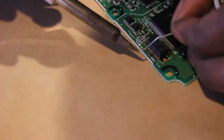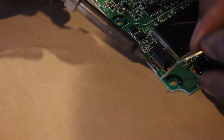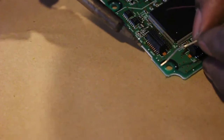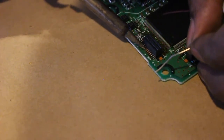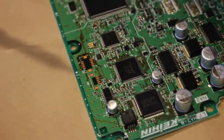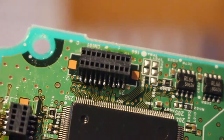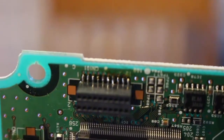I did have two of them jump. The best way to go about that is to leave them alone, let it fully cool, and then go back over one of them with the solder and iron — usually the solder will come back to that and then transfer to the iron itself. Here's a quick look at how they should look after. As you can see, some of them did not get a full connection — when that happens, you just go back over with heat or a little more solder. You don't need much.